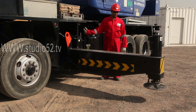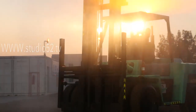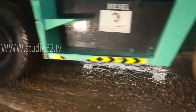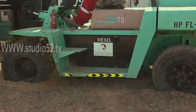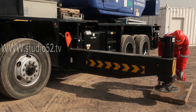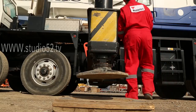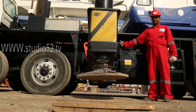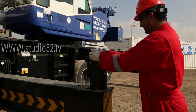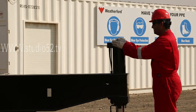Conditions for evaluating ground conditions include rain. Rain can cause a softening of the ground, thereby creating a potentially unsafe work environment. To address the problems posed by soft ground, ensure outriggers have matting in place under each fully extended outrigger. The matting should be strong enough to prevent sinking and provide added stability and support for the crane. Also ensure that outriggers are evenly extended, which will prevent sinking and give added stability and support.